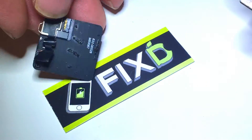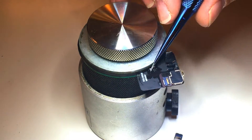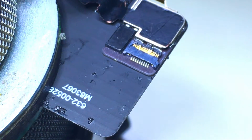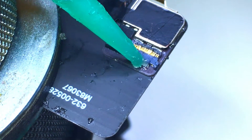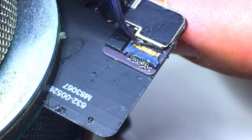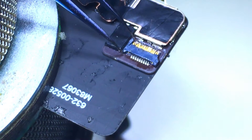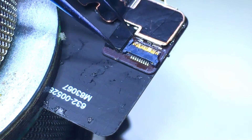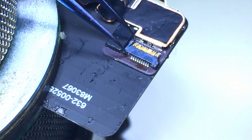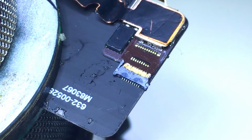I'm going to get out my little vice clamp that I use for soldering to hold logic boards and things like that. We'll clean away any extra adhesive that's visible because it will definitely melt — we're going to be using hot air to remove this. I'll take a little bit of flux and apply it to the connector. The connector is made of two different types of plastics; the actual flip connector here pulls away with the tweezers and melts fairly easily, versus the other piece of plastic which can take a lot more heat. Using a heat gun set to a fairly high temperature with a low airflow, I slowly sneak up on it until the solder is in a liquid state so that I can simply push the connector right off, then pull the heat away after the connector is away from the solder joints.